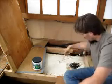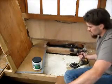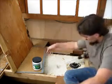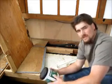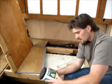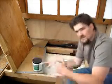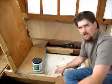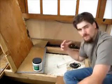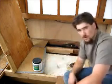I'm going to agitate it with this 5-gallon tank bucket agitator — so dump that in there. The important thing to remember if you're doing something like this to restore a holding tank is that this is an aerobic bacteria. I'm still trying to verify this, but I don't think it's as effective if your tank is full of fluid. You need to have it emptied out and flushed with fresh water to remove any chemicals that might inhibit the bacterial growth.